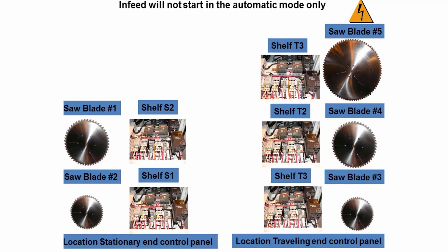Let's take a look at an example. If you were using five blades to make a cut, you will have five individual inputs from the auxiliary contacts on the five starters back to the input modules. When this happens, the PLC will sense that all five saw blade motors are running and it will automatically start the in-feed conveyor. If you only get four inputs back, as in this example, it will not start the in-feed conveyor. Just because you see all five motors are actually running does not mean that the inputs back to the PLC are working correctly.